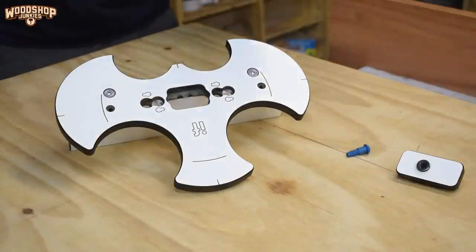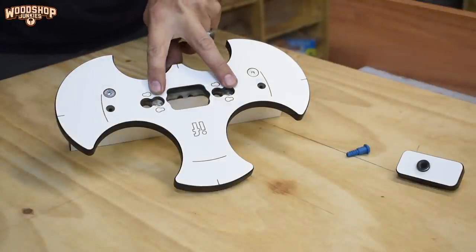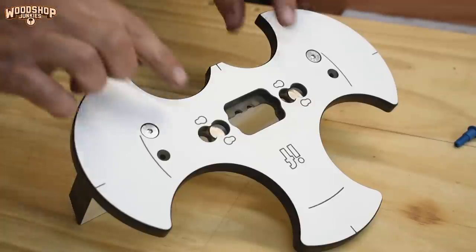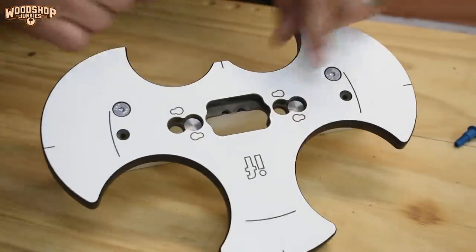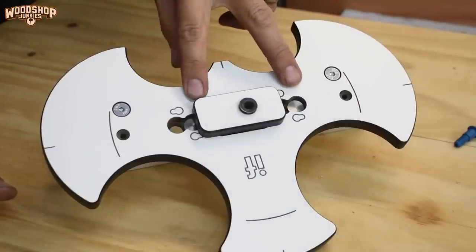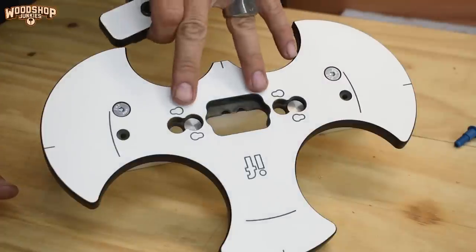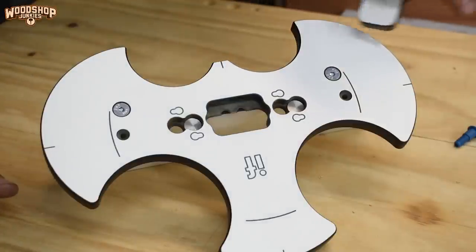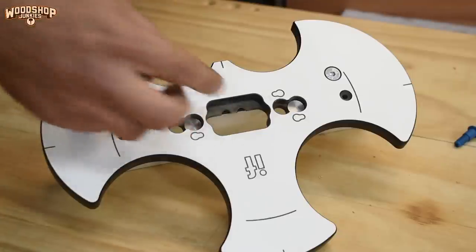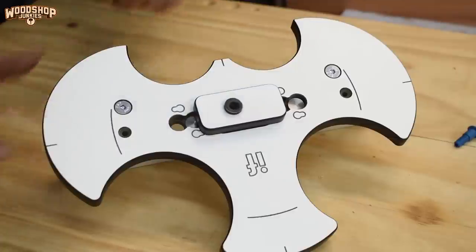Now in the manual, all of the joints are created by pairing the gravity stops on these or these holes, but it is only on the peanut joining method where it is critically important. With the gravity stops paired like this, the drill bush insert would be placed like this, placing the hole in the center of the two gravity stops. This is when we are going to create slots in that direction. If we are going to create the slots in this direction, the gravity stops go to the other two holes and the bush insert turns around.